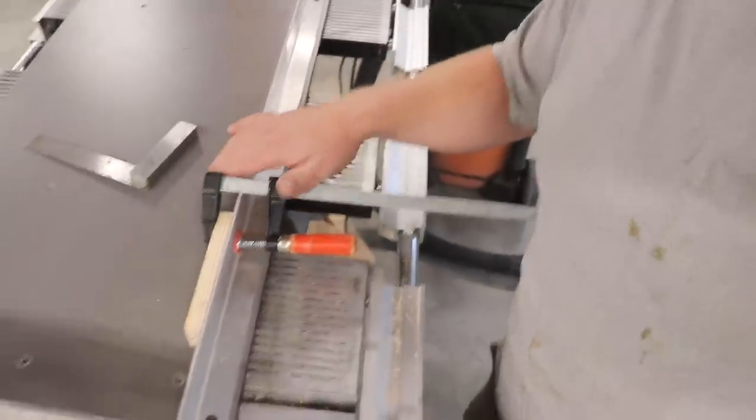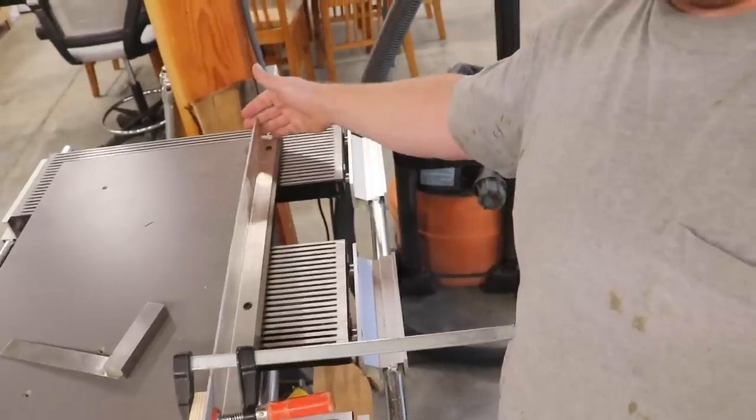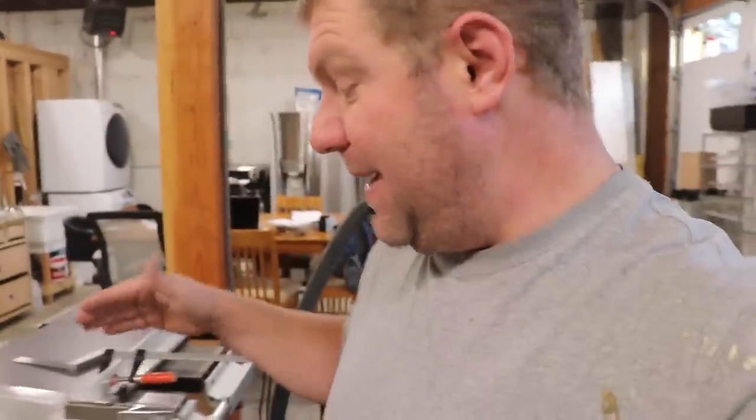I was able to basically make an initial cut with my miter gauge, and then I could use the block or stop that I set on my crosscut sled. I figured out that the crosscut sled actually is pretty friendly to setting a stop, as long as you're within about 31 inches, which happened to be about the longest cut that I had to make. It took a little time getting used to it, and then making sure that the miter gauge is in fact square to the blade.